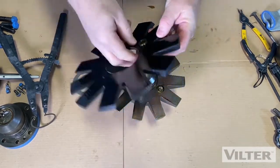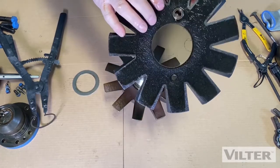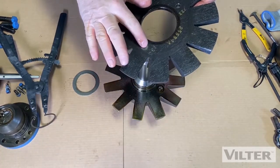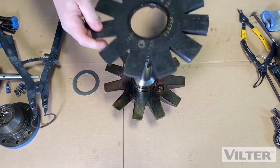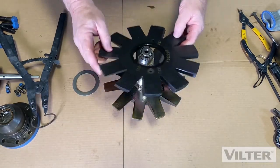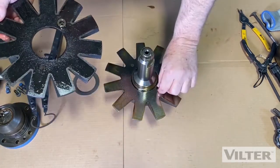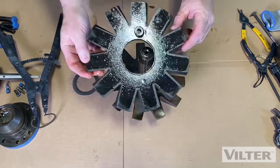You can see here's the bushing. This bushing has to be pounded out with a punch and is also reinstalled with Loctite — it comes in the blade kit. This is the bushing that wears. The pin doesn't wear, but the bushing does wear.